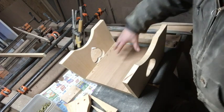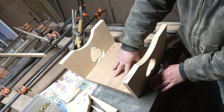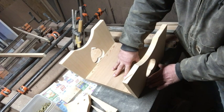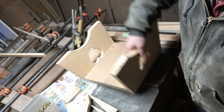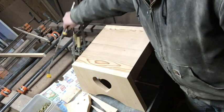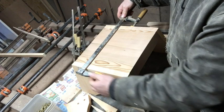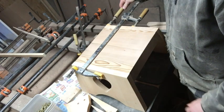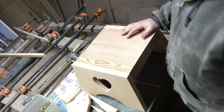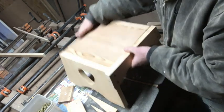I got you all caught up to another phase of assembly. When I assembled the two legs on the support piece, I applied pressure down after gluing the inside edge of the support piece. Then I centered each leg up against the back side of that support piece and took the staple gun and put four staples in to hold and secure the legs. After using the staples I took three small bar clamps with soft faces and clamped this together - one on each end and one in the center - and let it dry overnight.